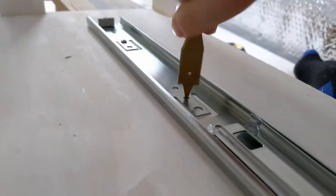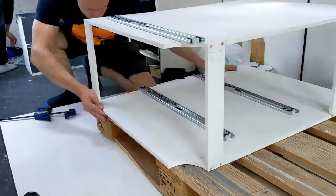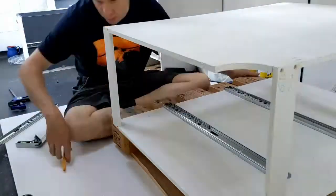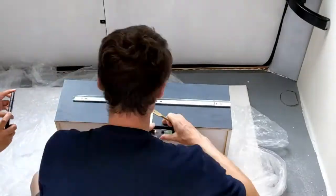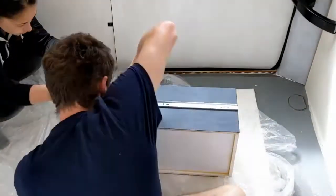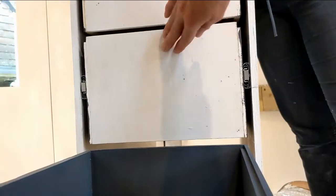Because the sliders are smooth metal and can slide around a bit while you're trying to drill them in, we found it helpful to put a center punch through the middle of each screw point so it went in nice and straight. We're using our metal sliding ruler, which we can slide up to a set measurement and secure, and running it along the edge of each drawer runner to make sure it's at the exact same height all the way along.